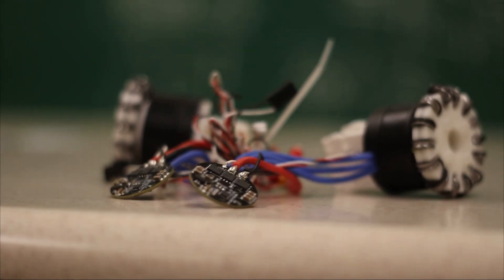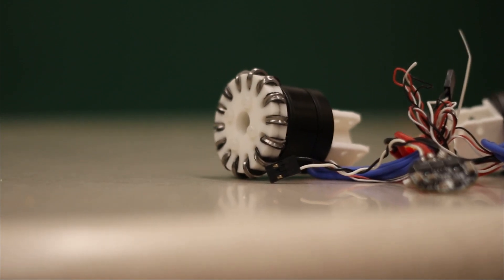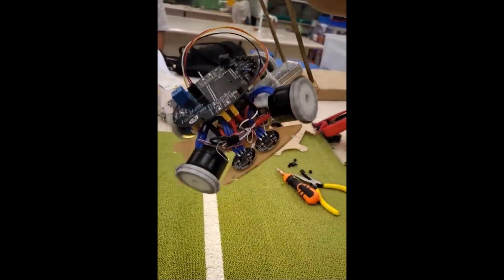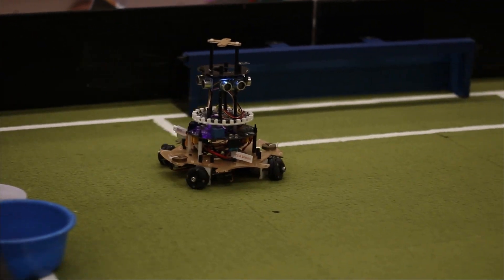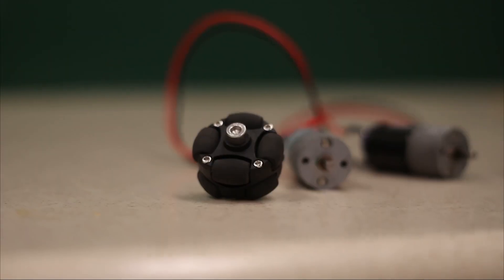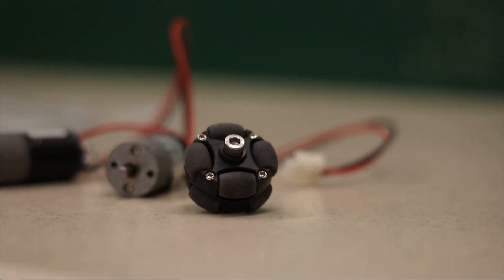Before, we had chosen the brushless motor PM3510 as our main motor with motor driver G1648. While the software team was developing the algorithm, we soon found that the motors did not have enough torque to power up the robot. It was a failure for the hardware team by not choosing suitable motors. We then changed to motors from Shihai, which have 600 RPM but lots of torque and are driven by BTN7971B.